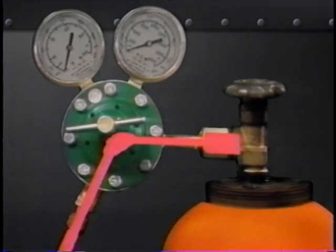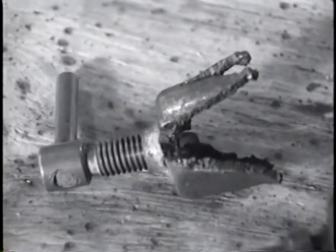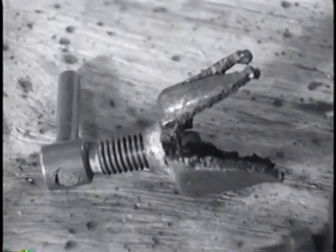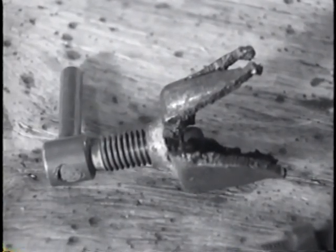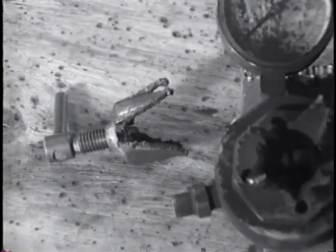The 2,200 pounds per square inch pressure in the oxygen cylinder slammed toward the regulator and started compressing the acetylene. When the acetylene got to some point above 32 pounds per square inch, it exploded. The explosion burned the man rather badly, but that didn't really make any difference because the adjusting screw on the regulator had already killed him. Remember, he was standing in front of it.